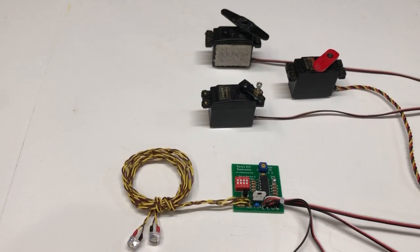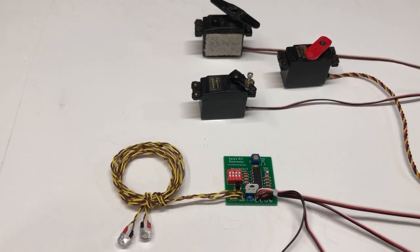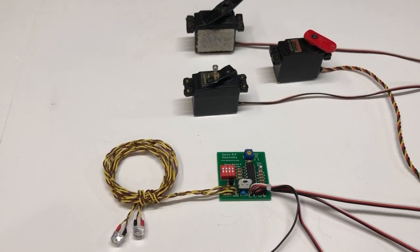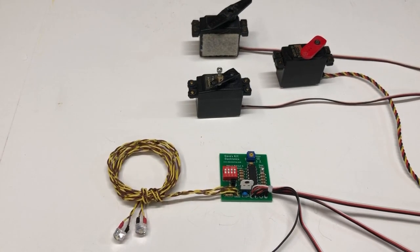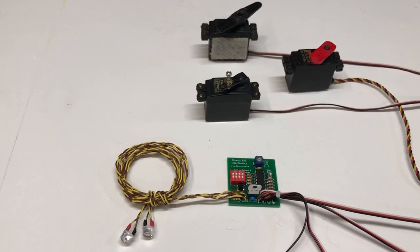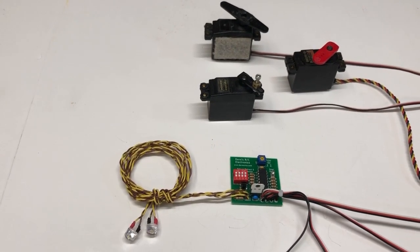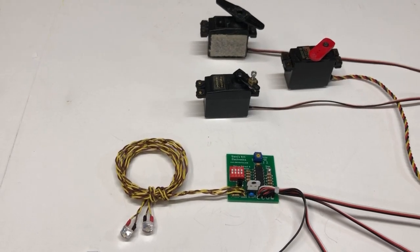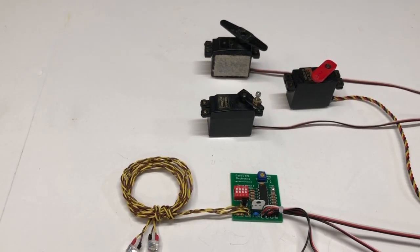Let's say you're flying around, you decide to land, and you give it the gear down command. The doors open and the gear starts down. Somebody's on the runway. We toggle our switch and the gear comes back up again, and after a suitable delay, the gear doors close again. So you don't have to wait for the gear to come all the way down and for the program to get into the gear down mode before you reverse it.